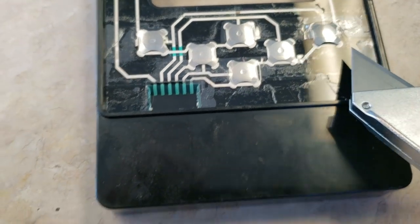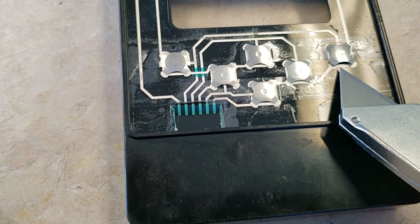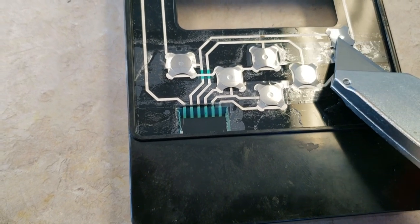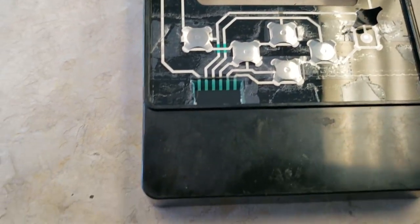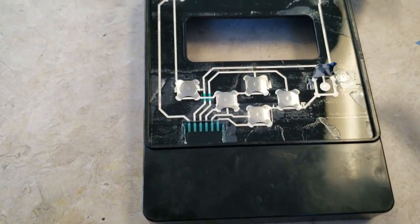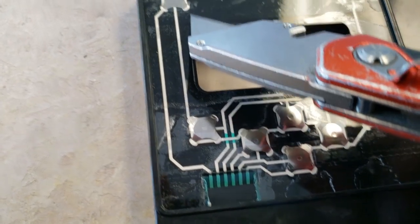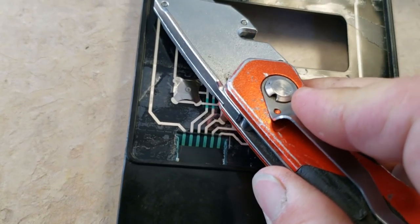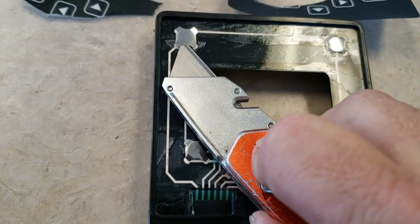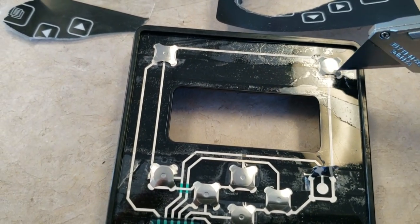Let's say this was a weekend call — Friday, whatever — they're extremely busy, you don't have a keypad, and the machine doesn't want to run. You can literally pull the keypad apart, take a heat gun, heat up the faceplate, peel back the cover, pop off the damaged button, move the good button over from the right-hand side, push it back down, and get the machine back up and running. This is by no means a permanent fix, but it does give you a chance to be a hero until you can get the replacement part ordered.